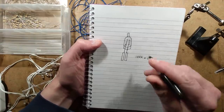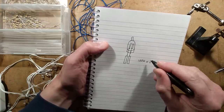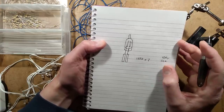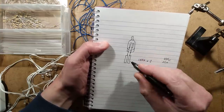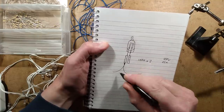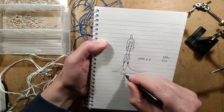In countries with 120 volt supply, I think 39k is normally standard - you could probably get away with 2 times 22k for 120 volt. Check the resistor rating recommended for the neons you're using and then half it because you're using two of them. The leads are going to loop out because it's going to be mains voltage going all the way along - in this case 240 volts.